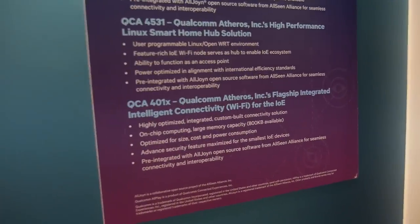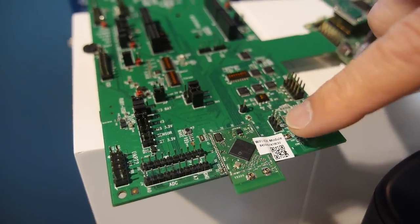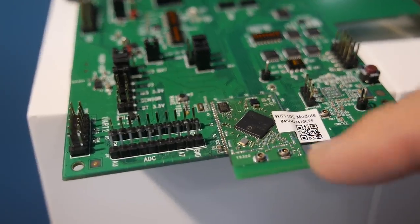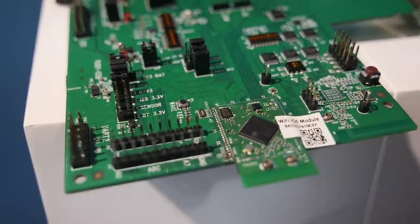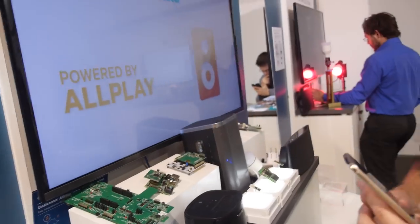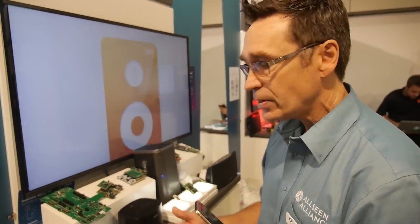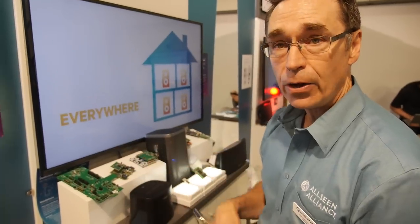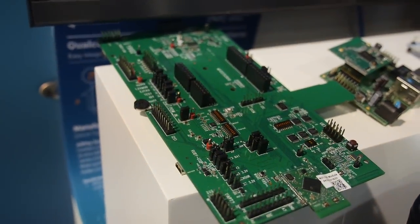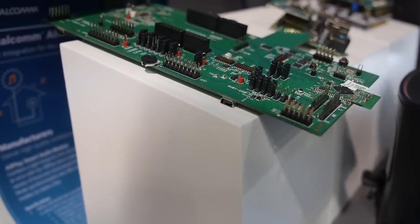The 4010 is our newest IoT developer platform — it's this board over here. This is a fully hostless solution: this is the Wi-Fi chip, and it also includes an MCU in it. It's also upgraded to 2x2 Wi-Fi. The MCU is a Tensilica core — it comes with up to 1.5 megabytes of RAM, with about 800 kilobytes available for applications. It's not ARM-based; it's ThreadX-based, with ThreadX as the operating system. We've added support for a lot of different IO, including PWMs to drive motors and light bulbs. This is the development board, but ultimately your finished product will use just that chip.